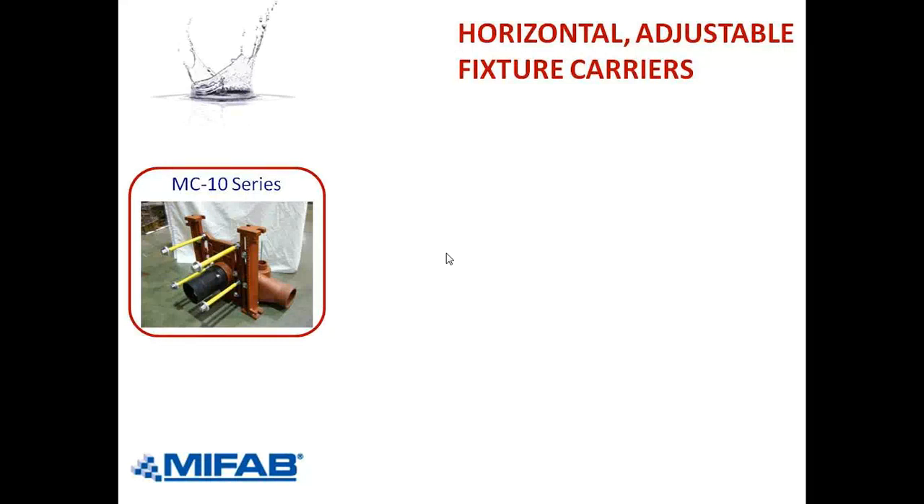You've got a typical ABS carrier that's threaded into the female-threaded faceplate. Behind the faceplate on the right, you see the fitting. Poking up on top of the fitting is our two-inch vent connection so that we can vent the connection. Right behind that vent connection, you can barely see a threaded rod. That's to anchor the fitting to the ground so that we don't get a cantilever effect in the event that we have a percher on the toilet — we want to make sure that back end is secured to the ground.